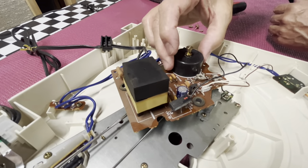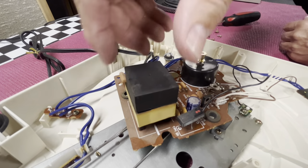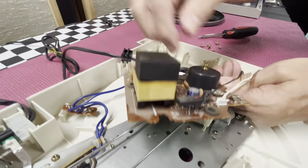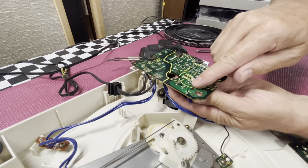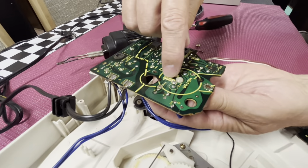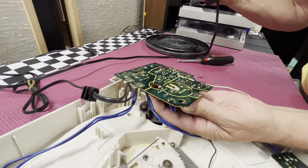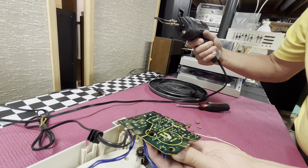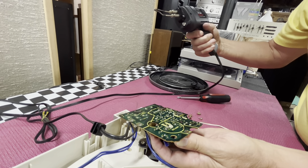You can see the motor has a rubber housing around the metal casing. We're also going to lubricate this shaft and the shaft on the other end when we have this apart. The Hall IC chip is actually sitting underneath the motor in a recess in the casing. On the board, these are the two motor leads and we have to desolder those. Because this is a magnetic field sensitive chip and the soldering gun is going to produce a magnetic field, I'm going to heat the gun up away from the motor assembly and use the residual heat to melt the solder joints and then pull the motor off the board. Let's take a second to get hot.